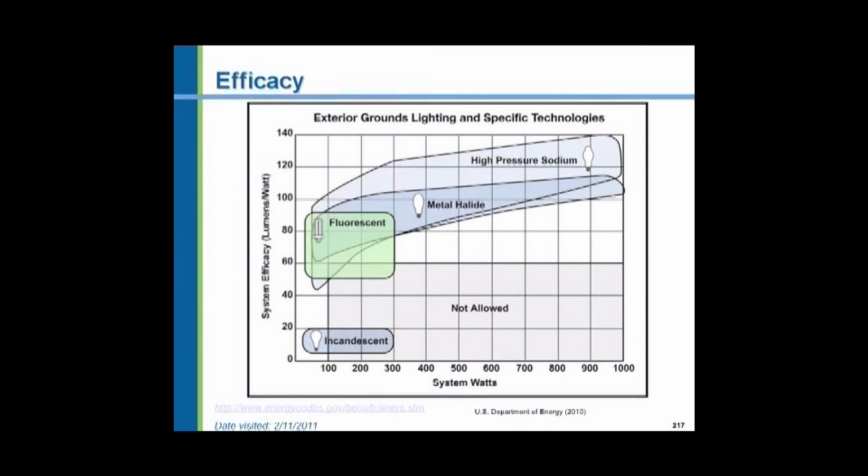They're on only when you open the refrigerator. They have to come on full brightness. There's no warm-up time that's allowed. And they go off as soon as you close the refrigerator. So those are exemptions. But basically all the rest of the incandescent lights will be going away and being slowly replaced by fluorescents or LEDs. Now, look at the efficiency or the efficacy of the fluorescent lights. And you can see in the range up to 300 watts, we're looking at efficacies anywhere between a little over 50 lumens per watt up to about 90 lumens per watt.